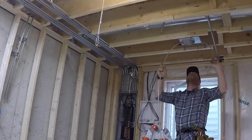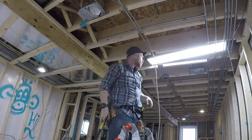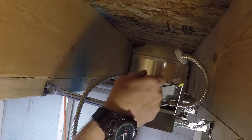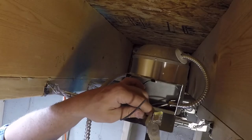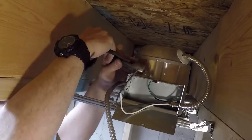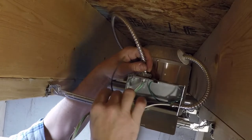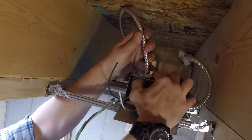Running the clad wire from the cans was super easy, especially since I left notches in the joists when I furred down the ceiling to match up with the existing electrical installed by the builder. Connecting the wire to the can is just like connecting conduit to the boxes — first cut off the connectors on the wires in that box because you don't need them, push out the knockout with the screwdriver, put your wire through, tighten it, and make it real tight.